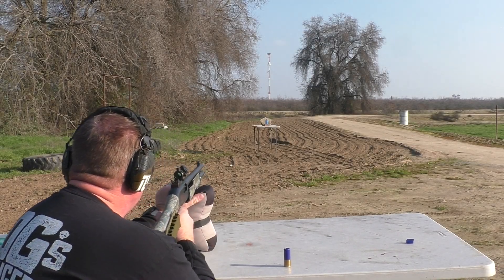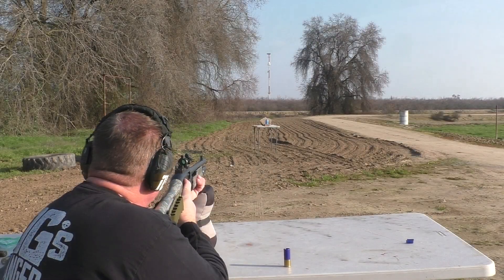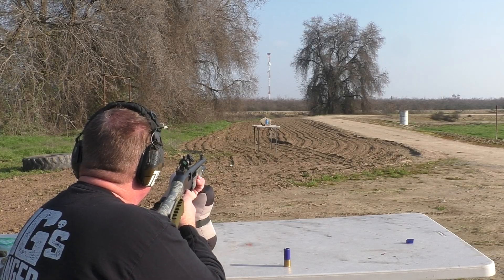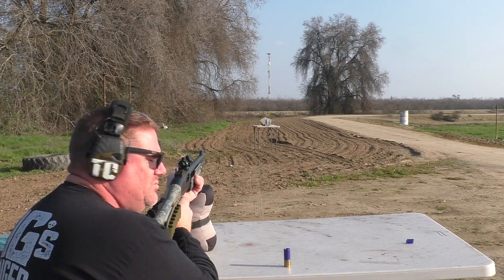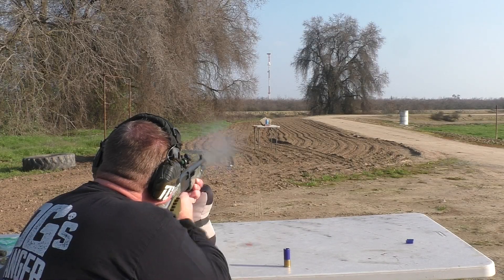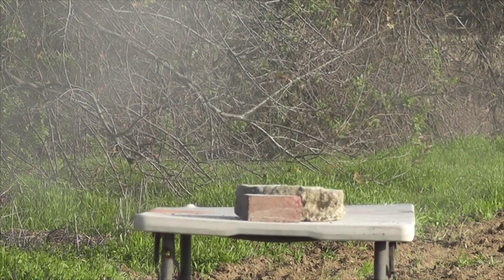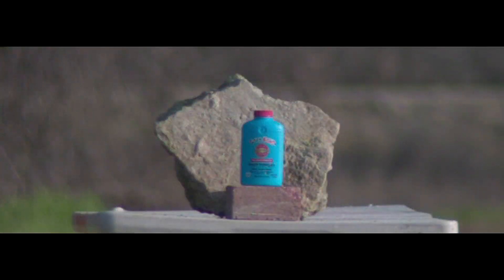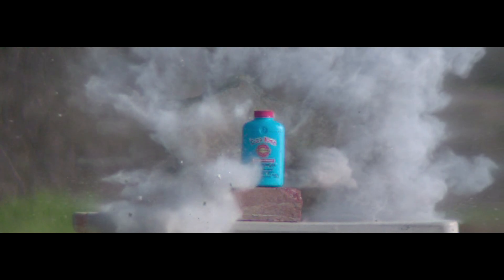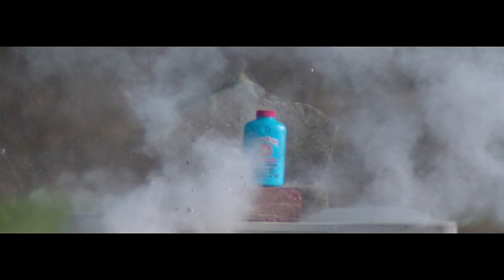Okay, smooth bore with the third design — we have four of these. These are going to have completely different ballistics so we've got to start from scratch. We'll go with smooth bore, see how those fly, and then try rifling. Here we go. Missed the concrete — but the good news is it did not break apart; it stayed in one piece. The bad news: it was not stable without any spin. The end result was a projectile that was not accurate but it did make a pretty spectacular dust cloud.